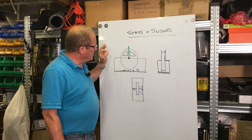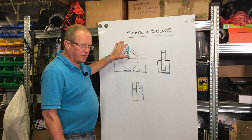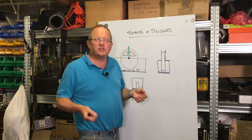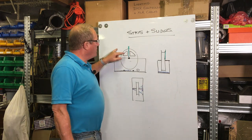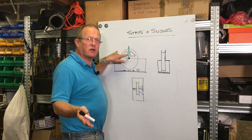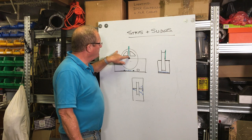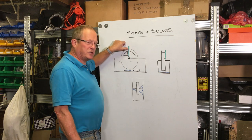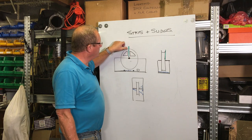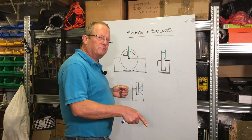Then we place a stay onto the centre of the wheel that is reasonably sturdy. We put a pivot point, which would just be a coach screw or a bolt, into the center point. Then towards the edge of the wheel, so there's a reasonable amount of force applied to it, we drill a hole through the stay and through the shroud.